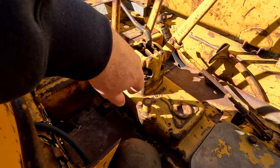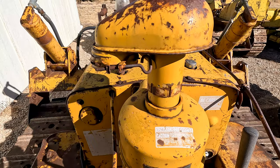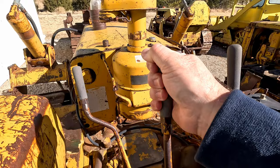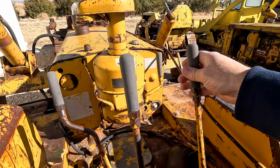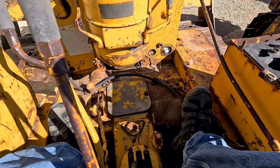The early 7U's do carry a lot of resemblance to the earlier tractors, but they change drastically over the time frame. We have pretty crummy looking oil in the transmission. May have some water in that. Unlike our 1952 toolbar 7U D4 in the shop, this one does not have quite as much wear, and a lot of this stuff is still free. Steering clutches — this one's kind of froze up, this one's still free. Not a lot of spring left in this step. Very sticky. Main clutch still kicks in and out. Brakes working and free. Not too bad.